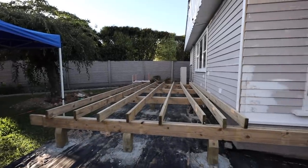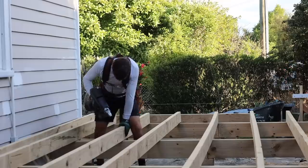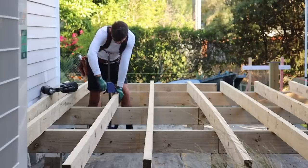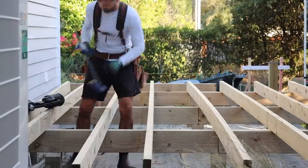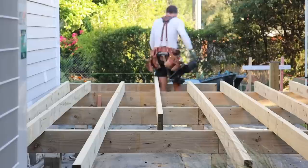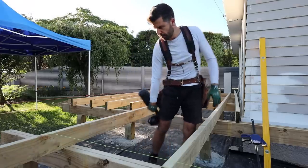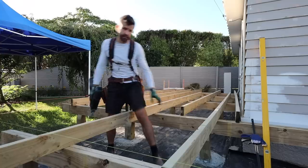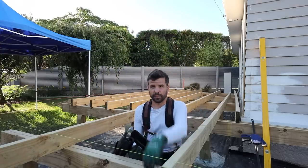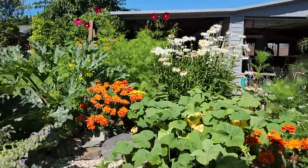There are a few things to consider, namely the fact that we're going to have a picture frame border around this deck and also the fact that we're going to have built-in stairs with no stringers. When you have a deck as long as this — going further than a length of timber — it's important to remember to stagger the joins on the joists. For example, I've got a long one here, this one stops back here, and then the next one over is long again. I do that because I don't want the joins to all be in the same place, as that could be a weak point where that part can move independently. So you stagger them.